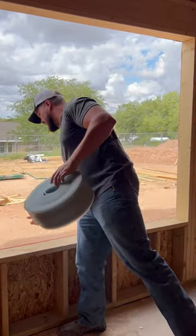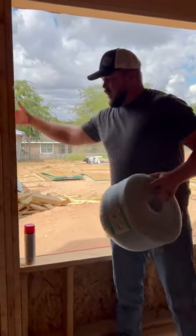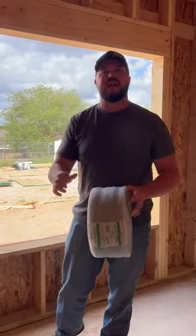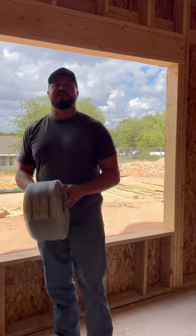You can go back and do your sheathing underneath this outside panel right here all the way around, and add in zip flashing or caulking to seal up that outside and try to keep those bugs from coming in.